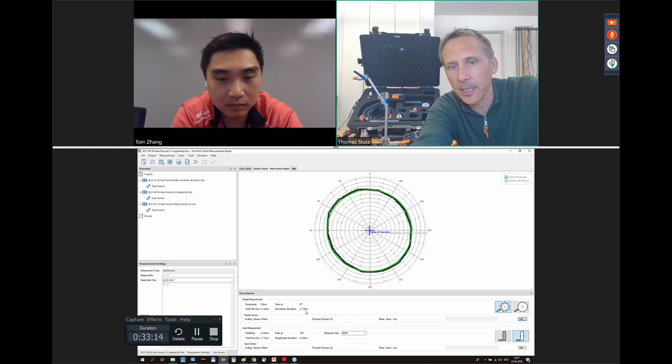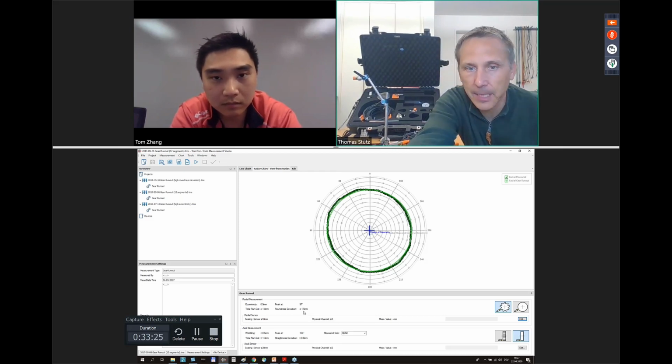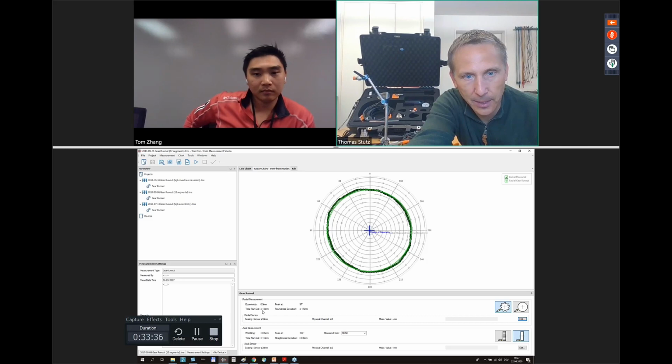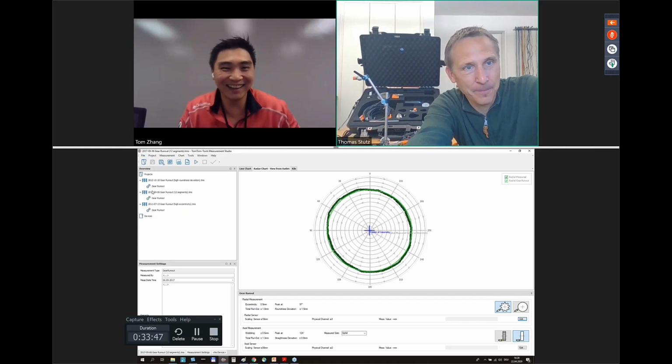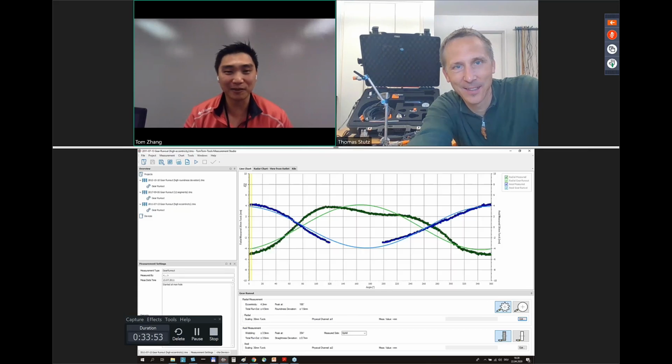If we think that this gear has maybe a diameter of 7 meter or something, so it's a huge gear, 6-7 meter outer diameter, but only 1.5 millimeter roundness deviation to the perfect circle, and we have eccentricity of only 0.5 millimeter. That's pretty good. It's a very nice example of a special gear. I don't think I've ever seen a 12 piece gear that clean before.